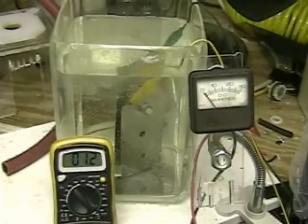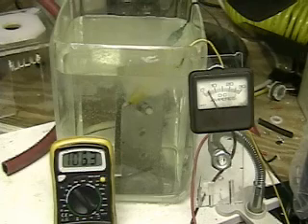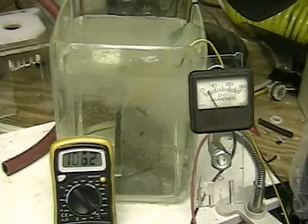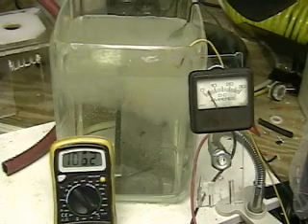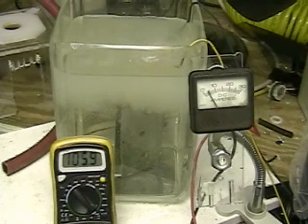As you can see it's already reset itself — it's drawn more than four amps. Now that we know approximately how much current it draws, we're going to plug it into the lab outlet which is fused at 40 amps. If you look on the bottom corner of the screen, that is the voltage — it's a hundred and six volts, and the amps is around five amps.